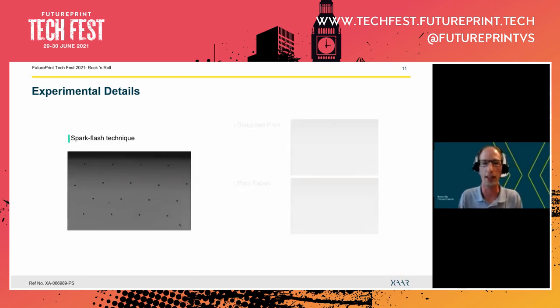So what that then looks like is something like this. We have here a screen with the shadow of droplets. And we clearly recognize here the A, B, and C cycle that's characteristic for the shared wall Xaar printhead. What we can do is use the distance and also the print frequency to analyze and obtain the drop velocity.